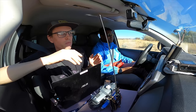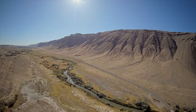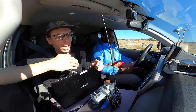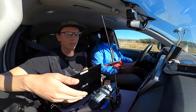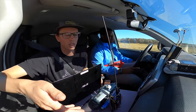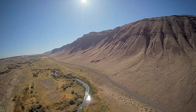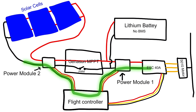It sounds crazy, but if you match the battery voltage to the solar voltage, you can actually do a pretty good job without an MPPT. I've put the MPPT back in, set up correctly with no floating ground — it's all isolated properly now. But the downside is we're now restricted to 75 watts, so I'm not convinced it'll be able to fly all day on solar anymore. I should probably remove the MPPT controller — it would probably do better without it. And last time the battery almost blew up, so this time I installed a BMS.